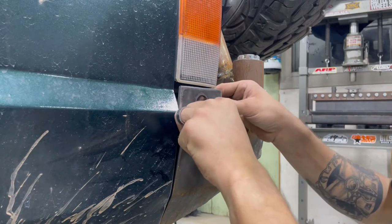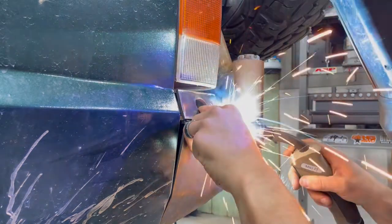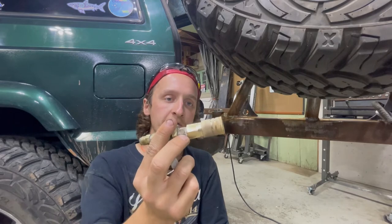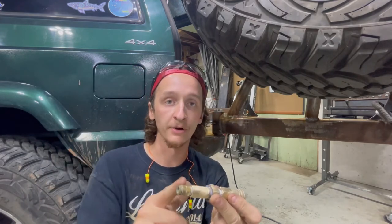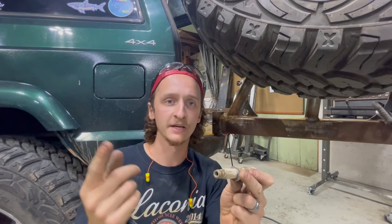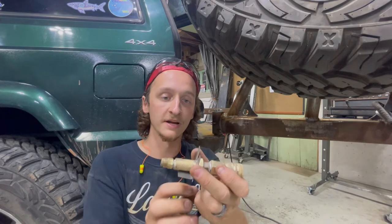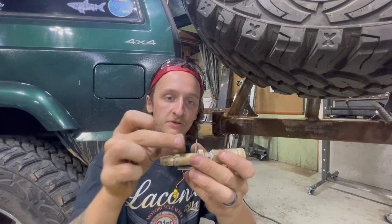So I made this little mount out of some thin sheet metal I had lying around. We're gonna see how it does with holding up my air fitting right behind this hole I made. This is just your regular shop air chuck on a bulkhead fitting on a 1/4 inch quick disconnect for an airline. Basically, we're gonna have the air fitting, the mount's gonna go right here, and then the nut gets screwed on right to the mount.